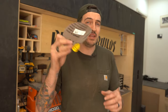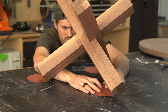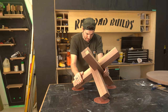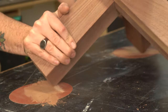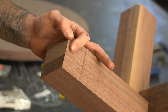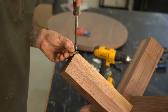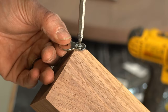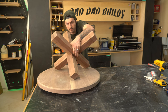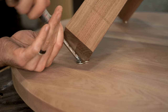To overcome this, I grabbed three sanding discs with a sticky back and stick them down to my bench roughly in the same area where the points of the base will sit. Then I give it a little shimmy until I get big enough flat spots to put felt pads on the bottom points to protect any flooring, and big enough flat spots at the top so I have enough room to connect a figure-eight fixing, which is what I'm going to use to connect the base to the top.